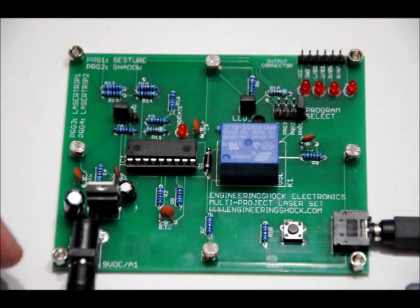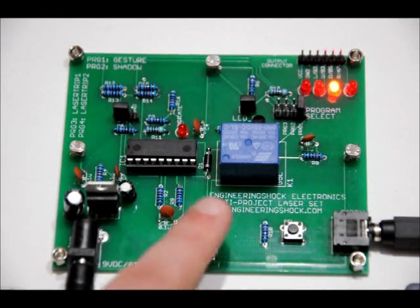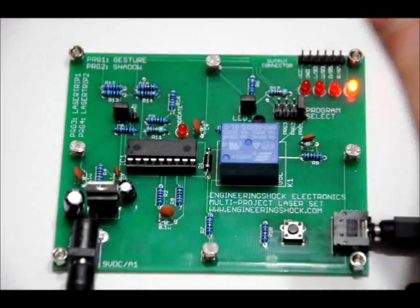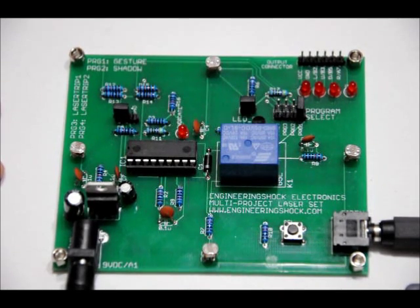If I cast a shadow over the left sensor — detecting a change in light — the left LED turns on and the left output turns on, labeled L. The bottom output and the bottom LED turn on for a short period of time, roughly 200 milliseconds. Likewise for the top and the right. I've written an Arduino code that's going to be included with the user manual for those who pledge towards the Kickstarter. I'm going to try to write a few different codes, but this one I've already written just opens a serial monitor and tells you which sensor has detected a change in light. You can still use lasers in this mode if you'd like, but the siren is not used in this mode or in shadow mode. This is specifically an Arduino slash TTL-compatible mode that allows you to easily connect your board to an external circuit.